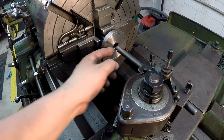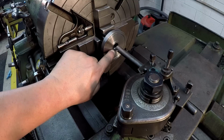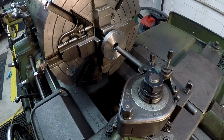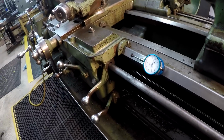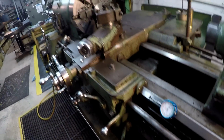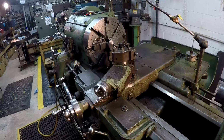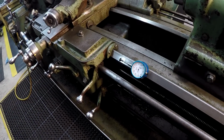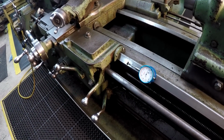We're going to get in there, we're going to touch the tool off, center up on this groove on this end right here, and we'll use our cross slide to set a light depth every time, and then we'll crank it using the carriage all the way through there to scratch an oil groove in there or scrape it in. And once I get this tool bit in there and I find that groove, we're going to set this dial indicator here on the back side to a 0 so that whenever I crank it back, I don't have to just look at it and feel it. I can actually just look over here and see this dial come up to a 0, and I know that's where I need to stop.